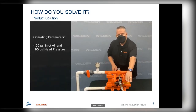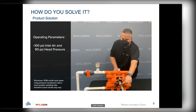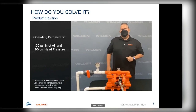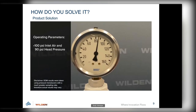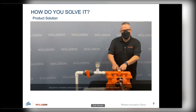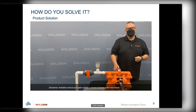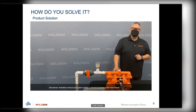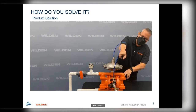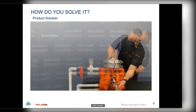We'll run the pump with 100 PSI of inlet air pressure versus 90 PSI of head pressure and capture the gauge pressure. You'll notice the high side and low side of the pressure — about a 30 PSI differential pressure. Each P220 pump has a vertical port that's drilled and tapped. Simply remove the one-inch MPT plug (or one-inch BSP plug for international threads), then thread in the integrated surge dampener. With the pulsation dampener now mounted onto the manifold, we use the same airline coming off your regulator — same pressure feeding both the pump and the pulsation dampener.